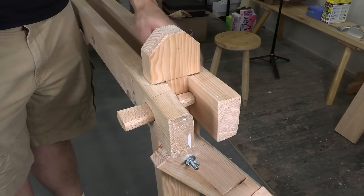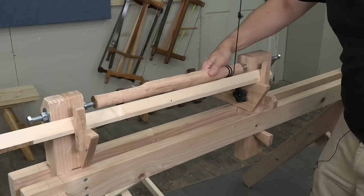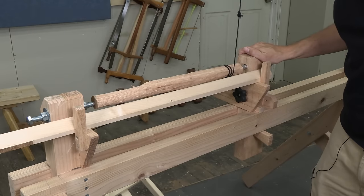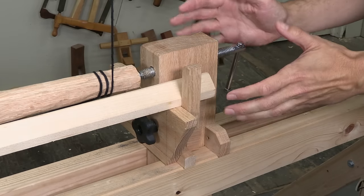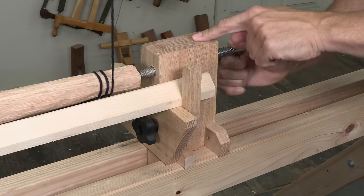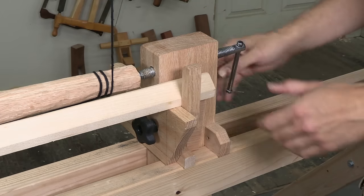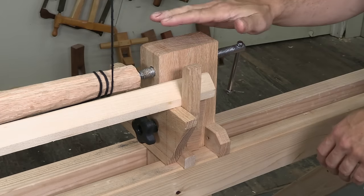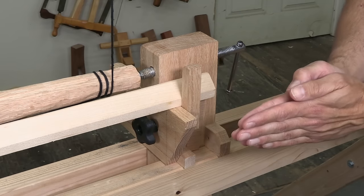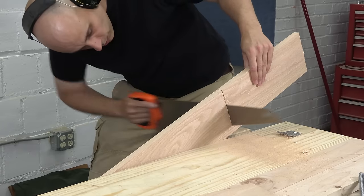After I've done this on both ends, I'm ready to start making the moving parts. The parts that hold your workpiece and allow it to turn are called poppets, and you need at least one poppet that moves back and forth on the bed. This movable poppet is a pretty complicated part — it needs to slide back and forth, lock in place, have an adjustable screw so you can loosen and tighten your workpiece, and it needs to hold your tool rest. That's a lot of stuff, and this could be a very difficult part to make, but I've got a bunch of tricks, including a simple laminated construction where we're just sandwiching together pieces of hardwood.